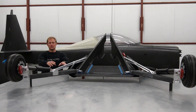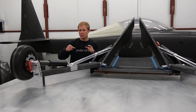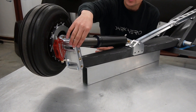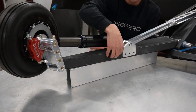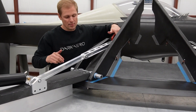You saw how we built the gear struts and how we assembled the whole thing. Now let's talk about the full assembly — there are a lot of parts here. I want to talk about the nomenclature so we're all on the same page. We've got the wheel and brake, attached to the trailing link. We have the shock, the gear strut, the strut bracket, the drag link — there's a lower and an upper drag link and a drag link mount.